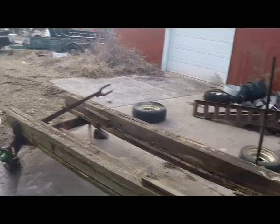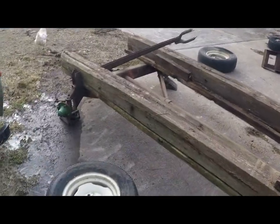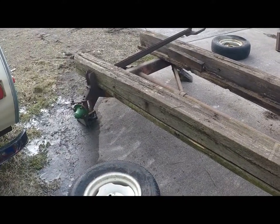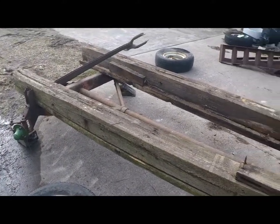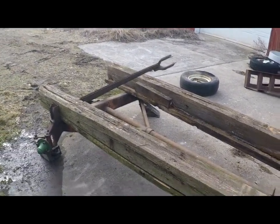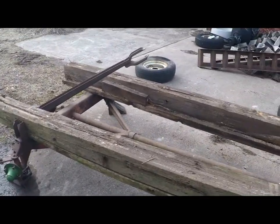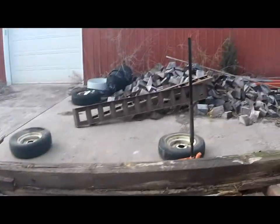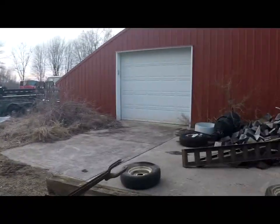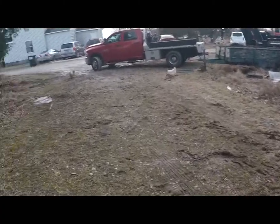Alright, the tires are off. I'll get those beams off when I get the excavator up this way. Tomorrow we'll go find some tires, and maybe tonight I'll try taking these off. I'll need to buy some valve stems — if you're putting on new tires you might as well put in new valve stems, they're pretty cheap. We'll use the excavator as a bead breaker, that works about the best. Now I'm going to go feed and work on some other stuff — we'll get you guys later.